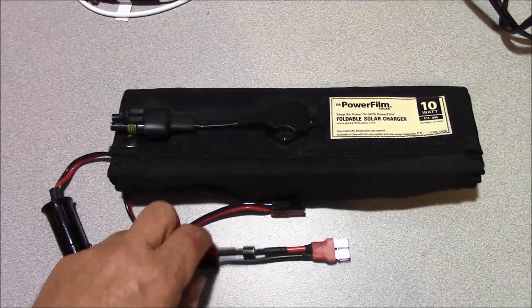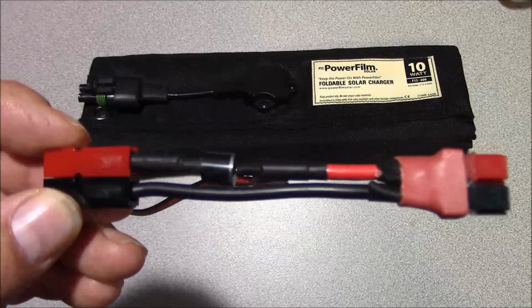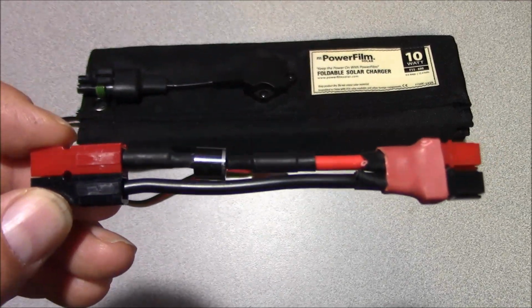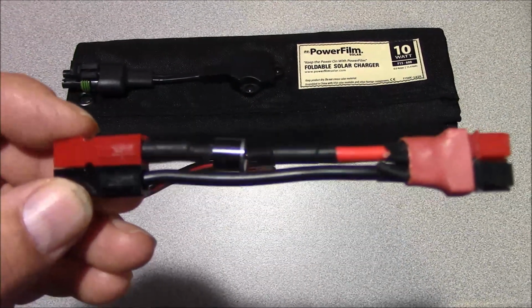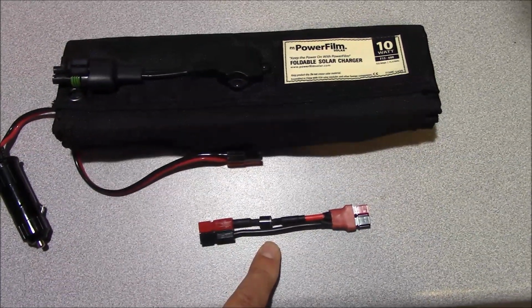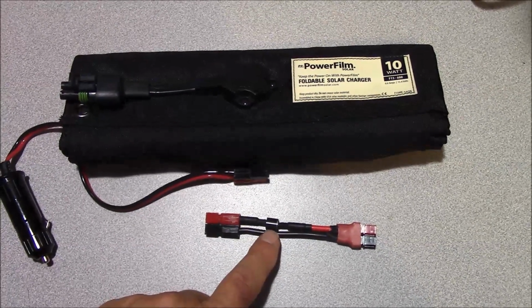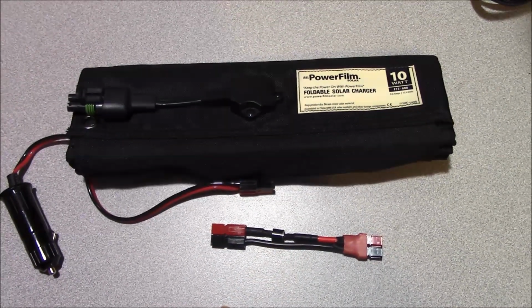And then I also have this, which is like the world's most simple charge controller, which is nothing more than a 10A10 diode and a couple of power poles here. This provides polarity protection and also does a small, tiny amount of voltage regulation through just a 0.6 of a volt voltage drop in the diode itself.